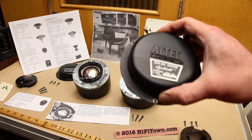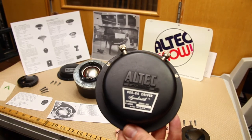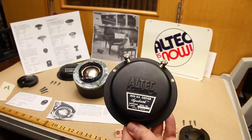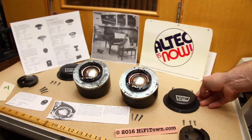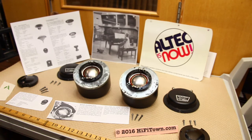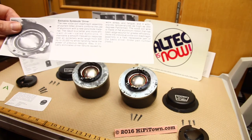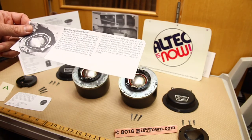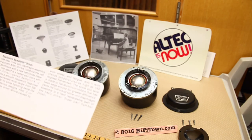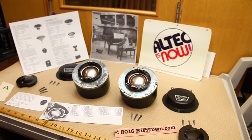This is — as you can see — a badge on the back of the Altec driver. At this point in Altec's life they had reached a stage where they needed to increase power handling in some of their drivers, and what's very interesting about this development was that the outcome wasn't quite what the engineers probably intended. So what is the Altec symbiotic driver? Well, somewhere in the very late 1960s, Altec devised a type of diaphragm that was basically the same as their 802 series and 806 series diaphragms, but a hybrid — it's part phenolic.